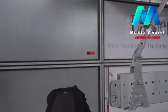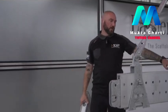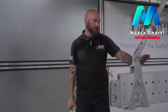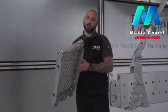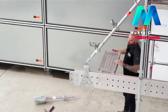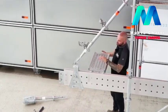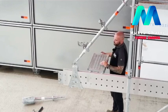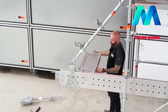So the speed and efficiency for us afterwards is that the FLEXBEAM's already got a U track for the Layher deck or board to fit into. Once the FLEXBEAMs are in place, the boards just simply all fit in, and can be slid out from either side to reduce working on an open edge. You can just work away and slide the boards out until you're fully completed.